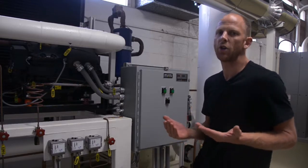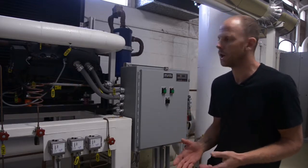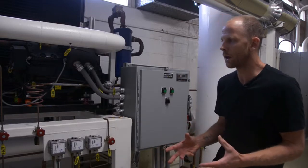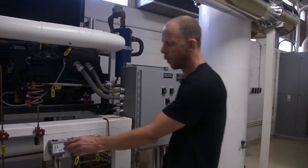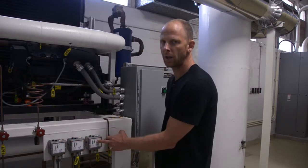So we may find that our chiller will begin to cool the air too much. And if we get air cooling too much, we will get moisture freezing in our evaporator, and we don't want that because we will block up the process. So we have 3 basic controls. One is our hot gas bypass, one is our unloader, and one is our fan control.